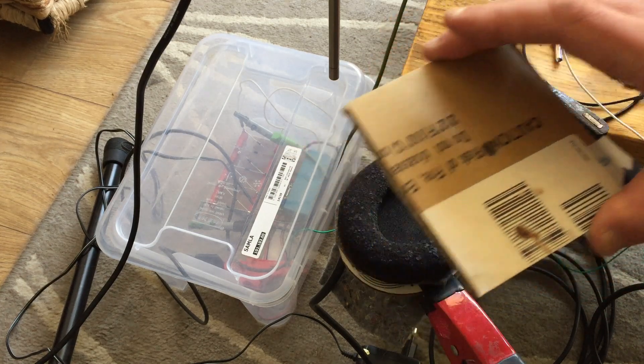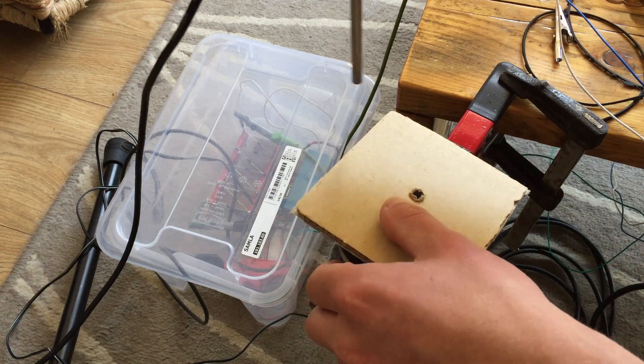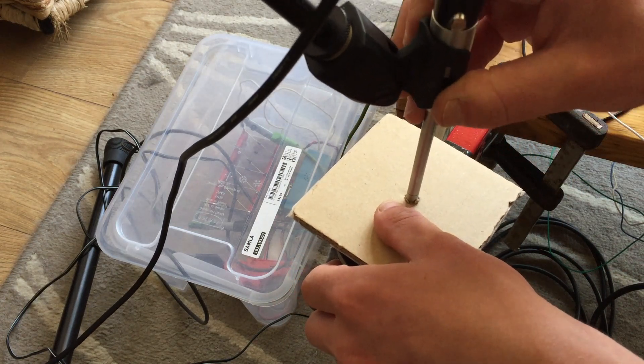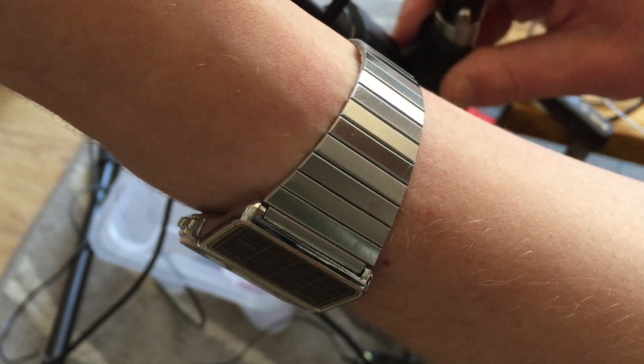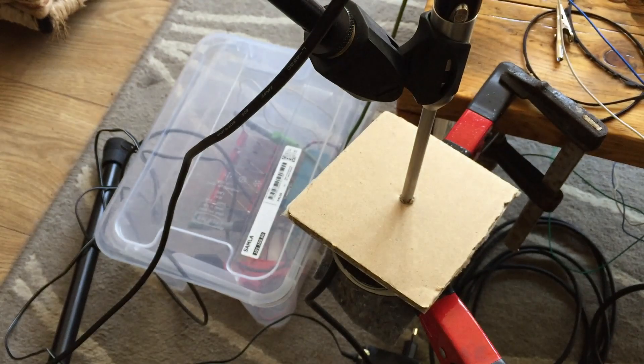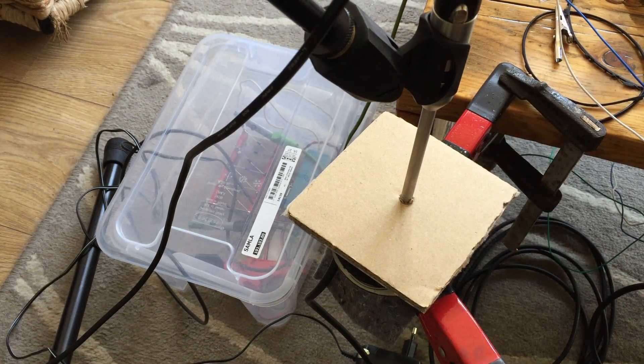I'll attach my head — it's a piece of carton. Then dump in my mic. I know pressure and a good seal really makes the bass go lower. But I think the resonance is too high for this panel. So I can go a few ways: decreasing resonance of the foil, which is hard to do, or just make the foil a little bit wider so you can still have a nicely evenly stretched foil and have lower resonance.